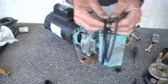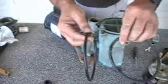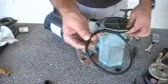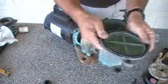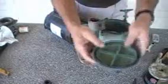We have a new O-ring. You can see the difference. The worn out one, one side is round, one side is flat. It's gotten worn. This one, both sides are round. On this here, it's just simply going to fit in the lid. Even if it doesn't fit all the way in here, once you get it back together, it will.